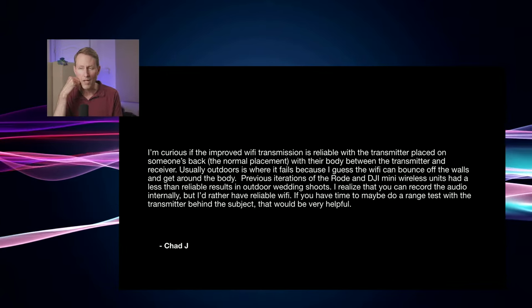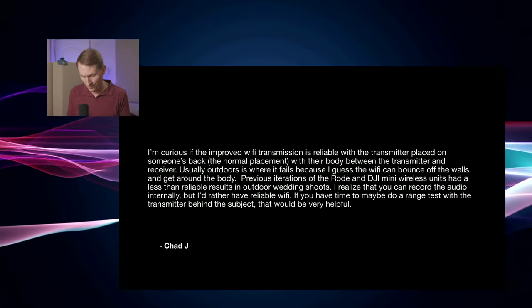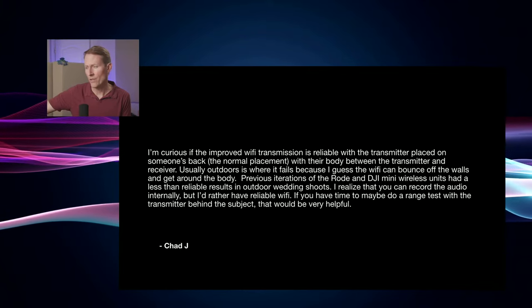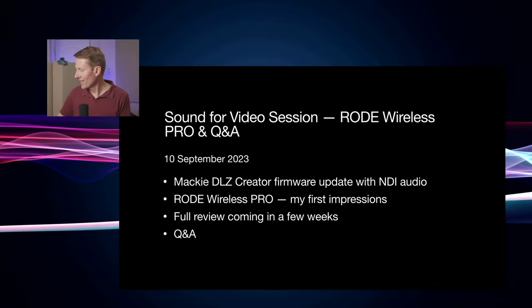Chad, that's exactly what I intend to do for the final review. That'll be posted on my channel, Curtis Judd, as opposed to this channel. But yeah, I agree. That's one of the challenges with these 2.4 gigahertz systems. They're great because they're digital. The audio that they can send is quite clean, but that's a narrow slice of bandwidth that you get to work with in 2.4 gigahertz.